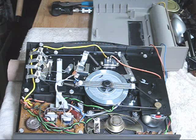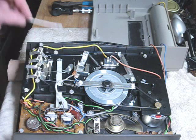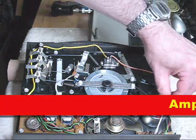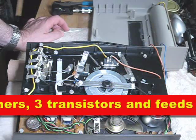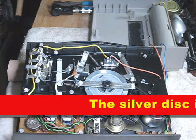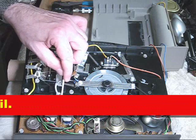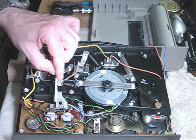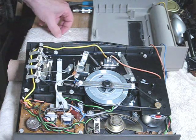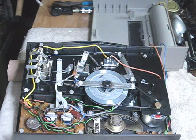This is the interior of the General Electric unit. It shows the amplifier board located here, the capstan flywheel which is quite large located here, the motor, and the speaker located here. The little indicator for the level is not a meter — it is a neon light. The amplifier board shows no sign of an AC bias coil, and the sound does not indicate AC bias either. The record/play switch is located here — this wire is probably blocking your view — and it slides over for record and back for play. I replaced the belt on the machine. The motor is a little bit noisy; I put a couple of felt washers to try and keep the noise from the machine.